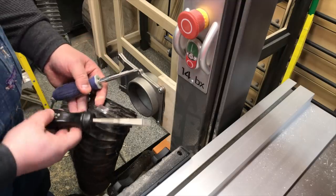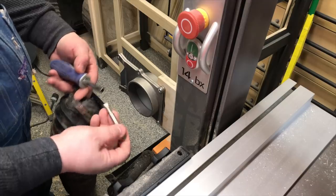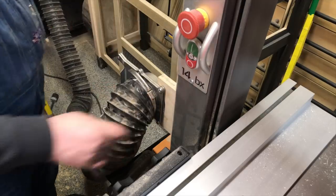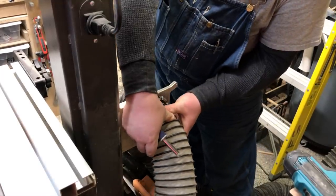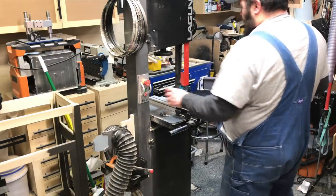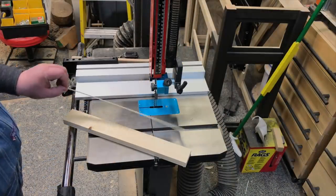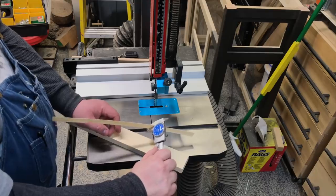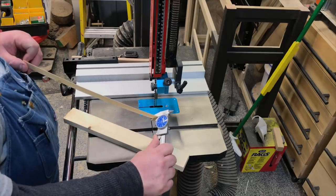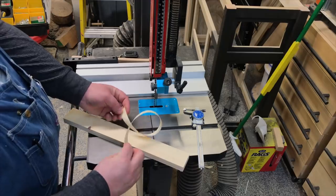A lot of interchangeable bit drivers are quarter-inch, so you can use them as a nut driver for five-sixteenths worm-drive pipe clamps — handy for tightening the hose clamp. We had the clearance built into the bracket, so we slide the dust collector hose over and tighten it up. Just showing off here — measuring the gate travel: 0.023, 0.024, 0.020, 0.023, 0.022 — pretty darn consistent.